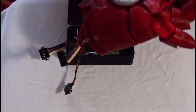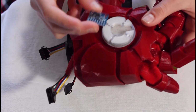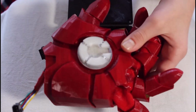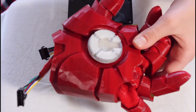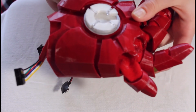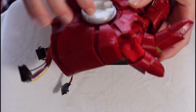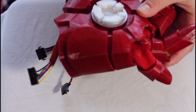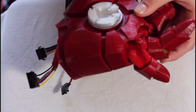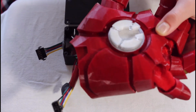There's an accelerometer in there, this little chip, I've shown you this earlier actually, and this little chip tracks the acceleration of the device. This then will send data back through the plug to the Arduino, and if it's over the threshold, it sends data back that tells it to light this up. And using Arduino's great digital pin analog system, we can actually make this fade in and out. So we make it just flash on, then slowly fade out, like it's getting quote-unquote fired.